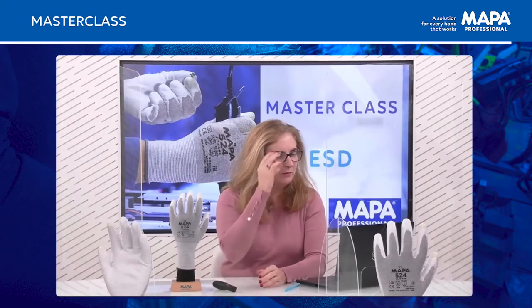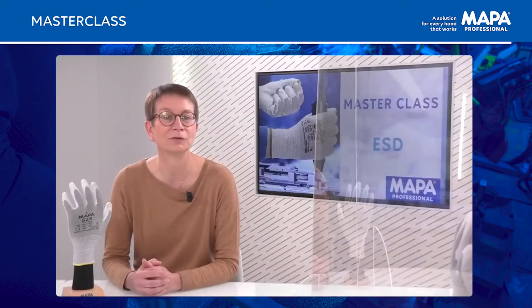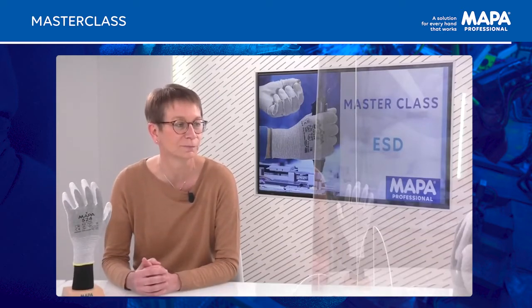Question two. Is it only really necessary for the parts of the glove that come into contact with the electronic components to be anti-static or dissipative? Beatrice, perhaps you can answer that question. It is necessary for the gloves as a whole to be dissipative, i.e. the part with the coating on the palm and the fingers, as well as the textile part on the back of the hand and wrist, in order to ensure the electrical continuity.